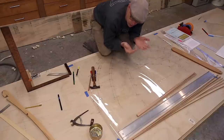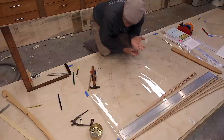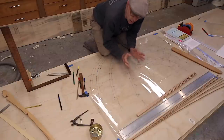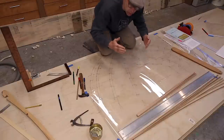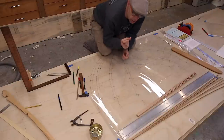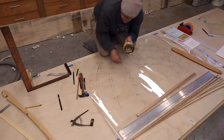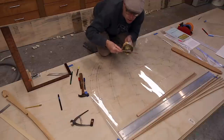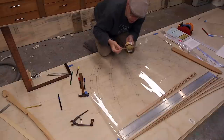I much rather think about the boat as the outside skin and then worry about how to build everything inside of it. So I loft that way, and as a result I need to figure out the mold reductions — which is either the payoff or the penalty, I'm not sure which. If you've got a long skinny boat like a canoe you can pretty much get away with just reducing the molds by the thickness of the planking. However, the more shapely your boat is, the more angle between the different stations, the more the relative thickness changes relative to the cross section of the boat.